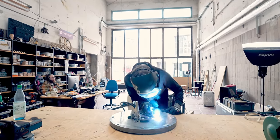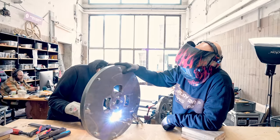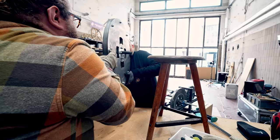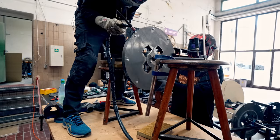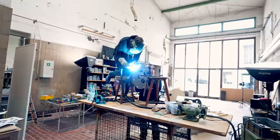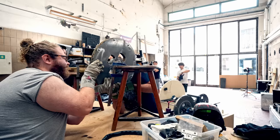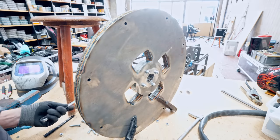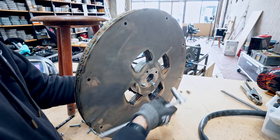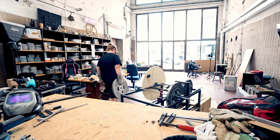Since I no longer need to take the individual metal parts apart, I can weld them together so they become one solid lump of metal. I'm now going to weld the outside, and to do that Carlos and Hannes are helping me build a rotary welding jig. With the welds in I can remove the bolts and we get access to turn all the sides of the wheel, which in theory would help a lot with wobbliness. This kind of sheet metal stock is not really created to be super flat, so turning the wheel true should make a big difference.